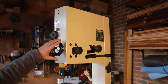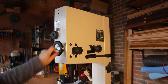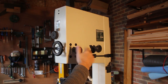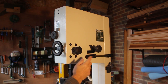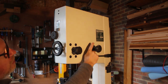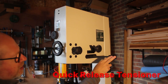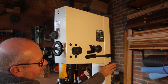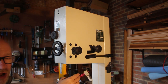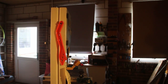Around the back, we have a lot of controls, but they're all easy to access. This one here adjusts the blade height, this one locks the blade height in place, and it's very easy to access from the front of the saw. This one is the tracking control with its locking nut, and then this one is the blade tensioner. Even the allen keys used to assemble the bandsaw have a holder. They even provided a place on the left hand side to hang your push stick.